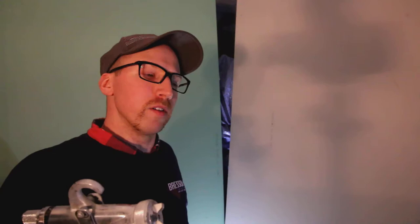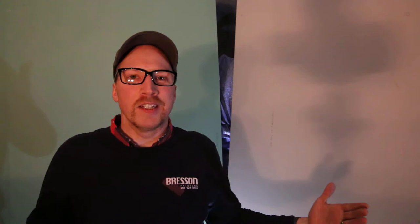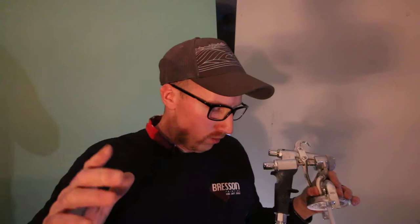The HVLP is very, very versatile. Like I said, all the different adjustments that you have, the spray pattern, size, whereas your airless spray system, I mean, that's it. You get your fan, you can turn your fan either vertical or horizontal, and then when you actually change your tips on your airless gun, it's gonna change your spray pattern, you know, from a 6-inch fan width down to a 3-inch fan width. There's not much variation there from an airless gun. With an HVLP, you can get so much. You can customize a lot here with one of these.